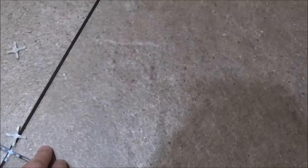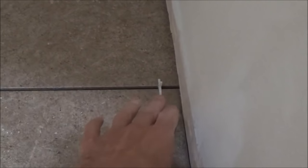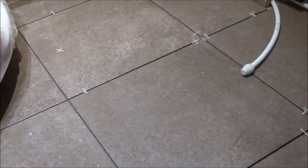If you look here, I've got one tile that's slightly tilted. I know that when I push it down, that end is the one that needs to be raised — so I need a little bit more tile cement in that corner because there's a slight dip. That'll bring that tile level with that one, and bring this one down level with the next. So these are the things that are good to plan before you get your tiles out. Take your time — you don't want to get that tile cement down until you know you've got it all sorted and possibly your edge tiles are cut.